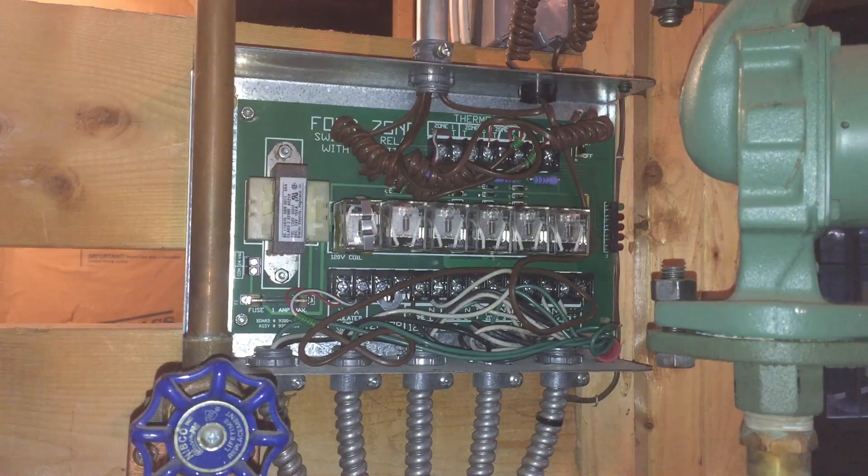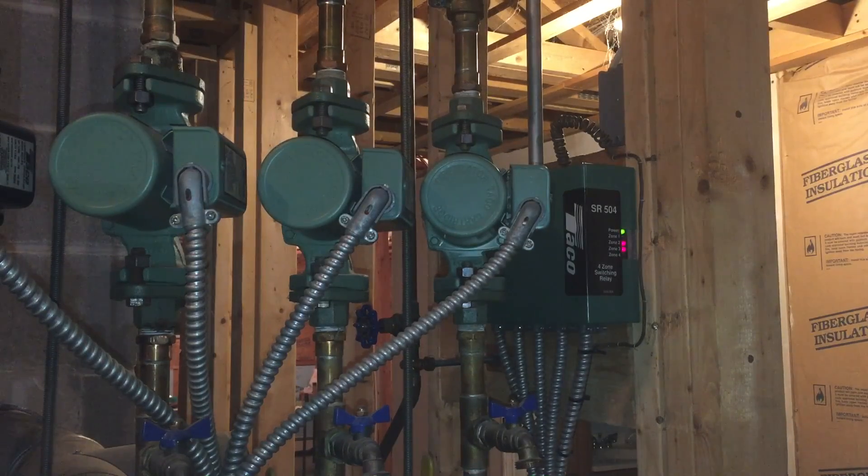I'm going to go turn the power on and make sure that things are still working. You can hear that the furnace has come on now and two lights are lit — zones two and three are now on. I'll try turning on the thermostat for zone four to make sure that comes on. I've run around and tested all the thermostats, turned them up and down, and verified that the zones come on as expected. I've put them back where they're supposed to be and the house is heating back up. As you can hear, the boiler is running — it's quite noisy.